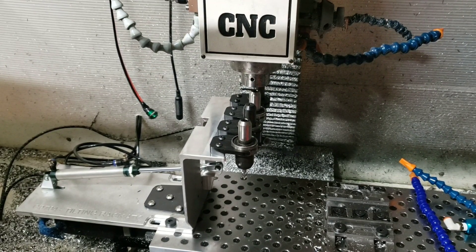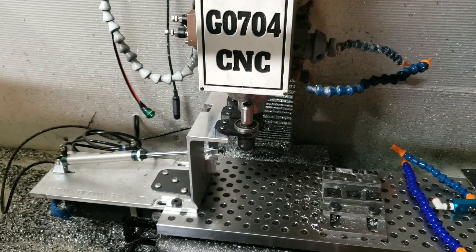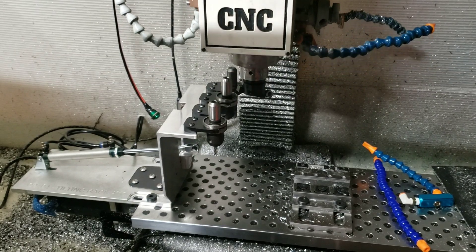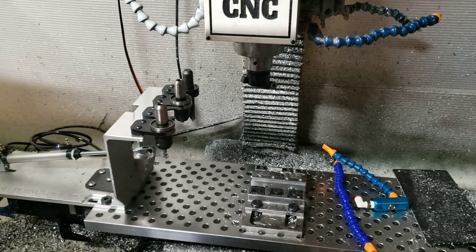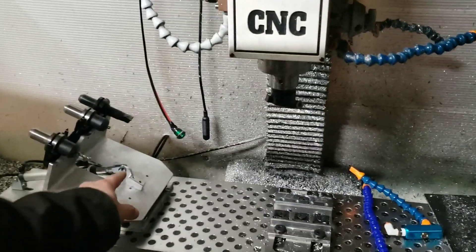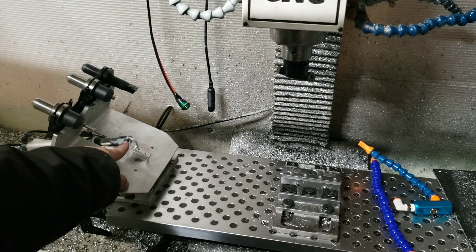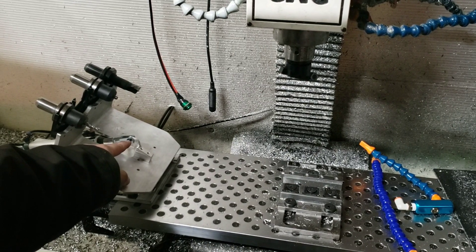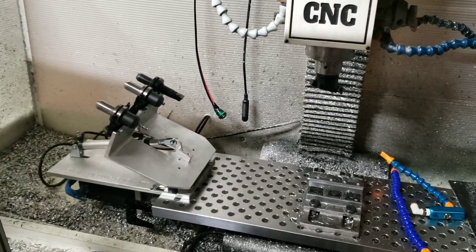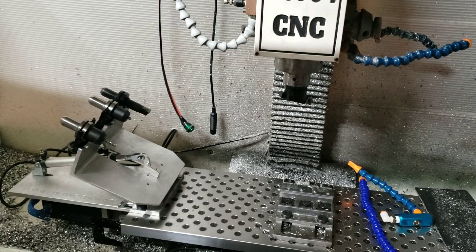Timing to clean off the top of the fingers. Working good - there is a little bit of slop in the provided bracket for the pneumatic cylinder. I'm actually going to turn an oversized pin in the lathe to take up that slop, but other than that this thing is rock-solid.